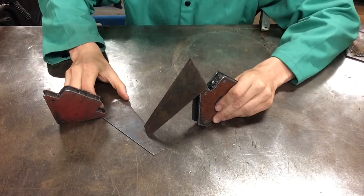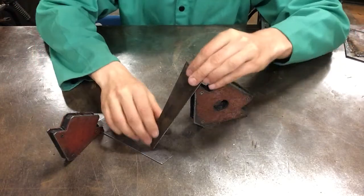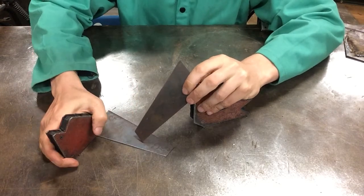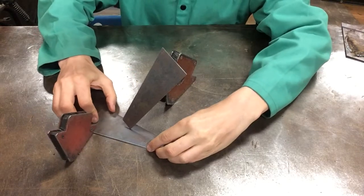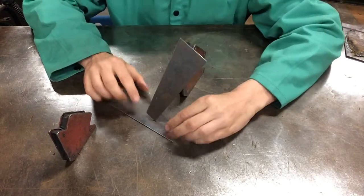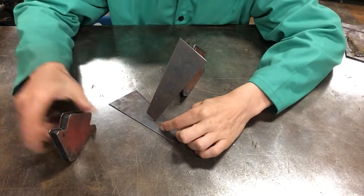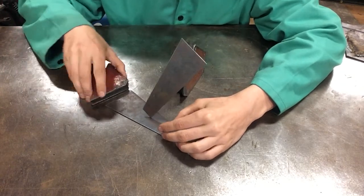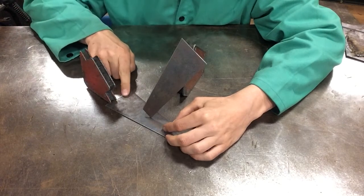So what you want to do is take the time to get all of your sculptural or structural ideas in place, right? So that you can easily see what you're doing and so that your metal is completely stable in your process. So you go, okay, this is what I want. I want to weld this vertex right here. I've got my sheet metal clamped. It's not going to move. And I'm going to use this little magnet to hold the bottom sheet metal in place.